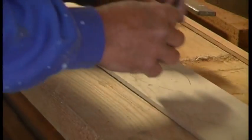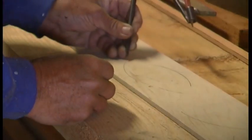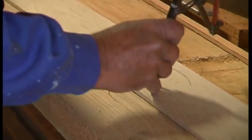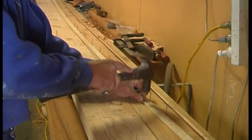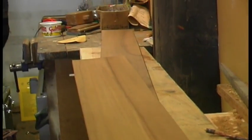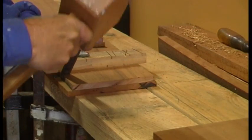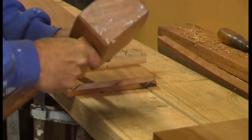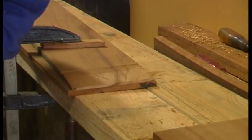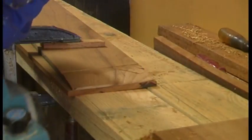A series of arcs is marked on a temporary batten and then transferred onto the plank stock by finding the origin of each of those arcs. In this case I'm actually marking the plank shape onto the bench, as it was a curved plank that needed two lengths joined at an angle, and I needed to know how much territory the timber had to cover. Nails are tacked into these marks and the plank edge is drawn in around a flexible batten. For this curved plank, two lengths of cedar are joined with a stepped scarf joint cut with hand saw and chisel, roughed out with a power plane and finished with a hand plane.